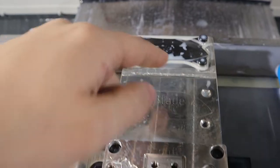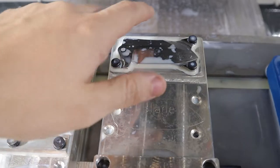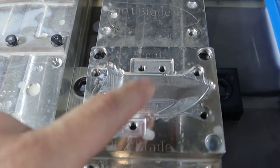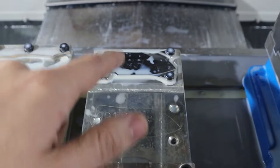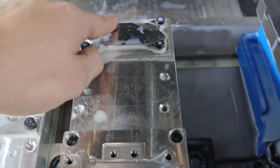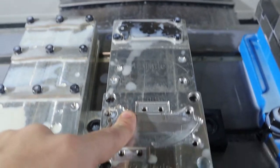Technically speaking, if we take this flip it over and put it in here it should fit, but there's this thing called tool deflection. The issue is when we take this off I cannot locate it back to the fixture to cut it, and if it doesn't fit in here it means we have to cut the contour of this wider. I could actually measure this with Fusion's verification tool — I think I'm going to try that and see if it actually works.